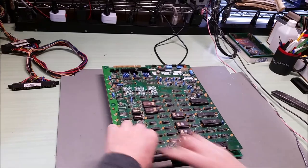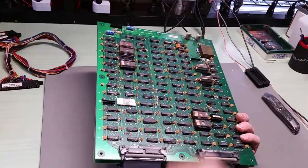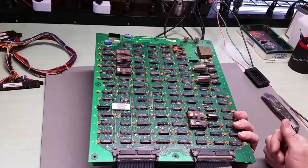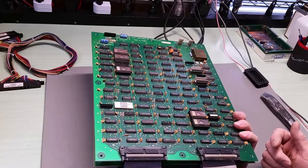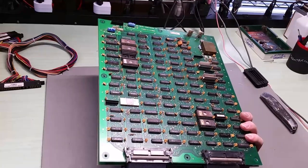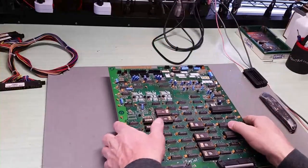I don't know why it said no chips - they're all there. So we've got a Donkey Kong, looks like everything. Oh, we're missing one EEPROM - a 2716. Not a big deal. How that'll show up is one half of every sprite will be missing half of the colors, so it'll be like a box around half of the motion sprites.